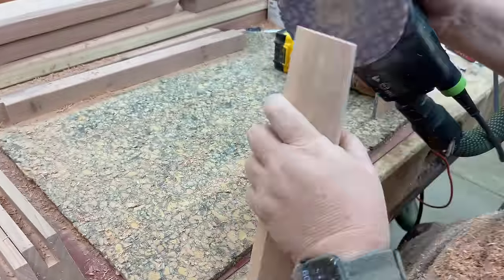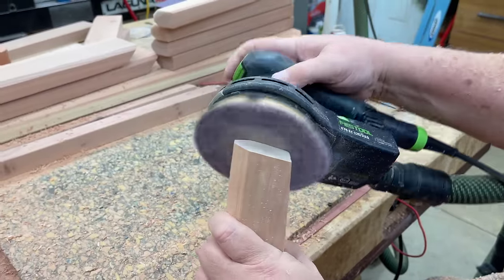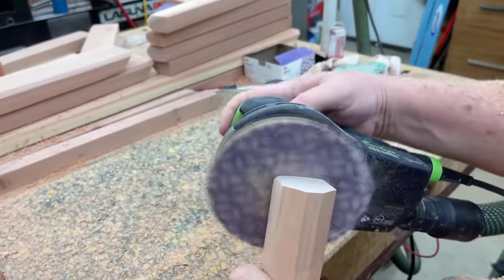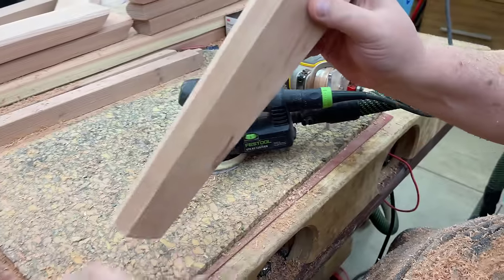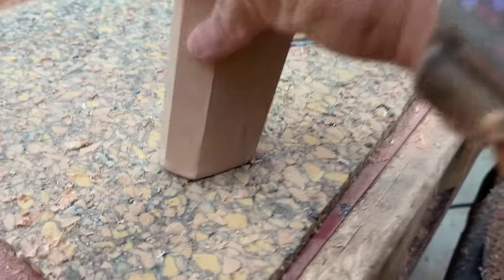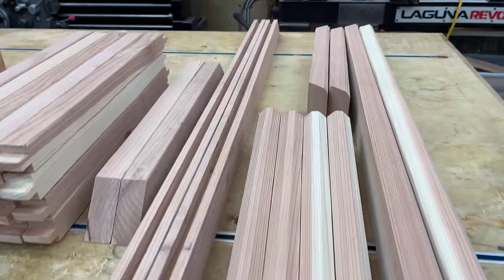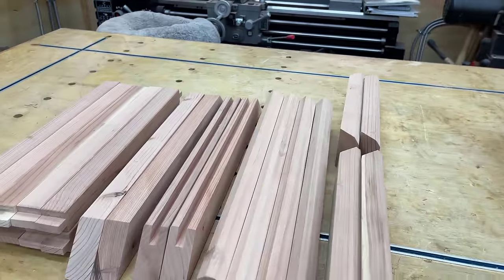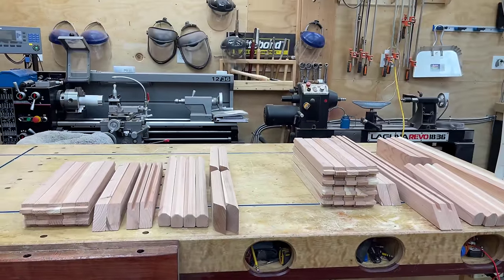For the bottom of the leg, I'm going to take some sandpaper and round over all of these edges on the bottom, because these tables tend to get scooted around on concrete or whatever, and they'll chip and split off. Once the edges are rounded, these things will slide around without chipping or scraping up the bottoms of the legs. And here we go — there is the complete set of pieces for the coffee table and the complete set of pieces for the end table. Next we will move on to some assembly.